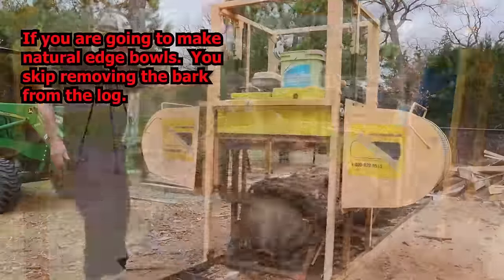Now here's our long-term plan. We are gonna pick them up, grade them, find out if we got any that's got real problems that we wanna reject right now. And if they're good, we're gonna anchor seal them. And once we anchor seal them, we're gonna lay them out here for about 3 days. Then I'm gonna come back and pick each one of them up and re-grade it 3 days from now. And we're talking about Texas heat, so if you're northern, you may want to lay them a little longer. And I'm gonna turn it over and look for excessive cracking in the bowl.